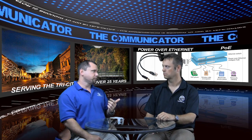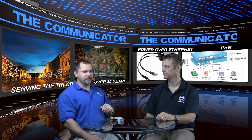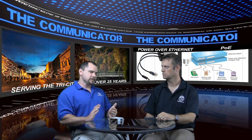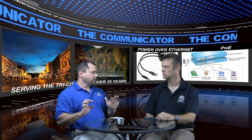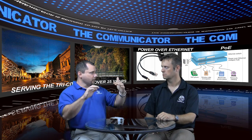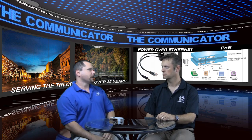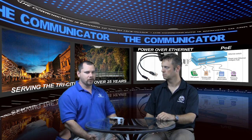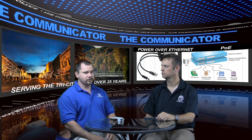Another option is putting in a PoE patch panel. There are times you might have a Layer 3 switch already placed that you've spent a lot of money on and don't want to replace just to power devices. What you'll do is incorporate a PoE patch panel — it's a 24-port patch panel that supplies 12 ports of PoE. They make a 48-port model that gives you 24 ports of PoE. You come out of your standard patch panel into the bottom of it, then back out of the top toward the device, injecting power mid-span. That's a really good solution if you already have switch infrastructure you don't want to replace — most people don't even know that's an option.